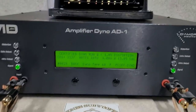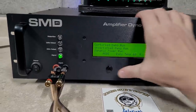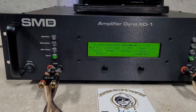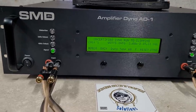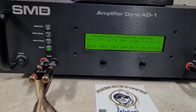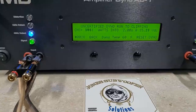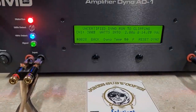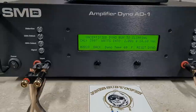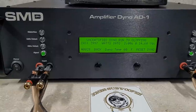Let's set that aside and go into uncertified runs — uncertified goes all the way to distortion. Starting again at two ohms, starting at 15.3 volts. We got three thousand nine hundred ninety-seven watts into two ohms, dropping to 14.6 volts.